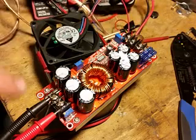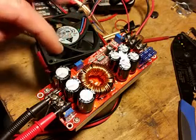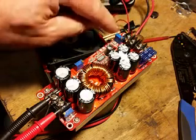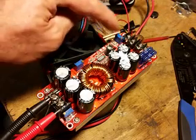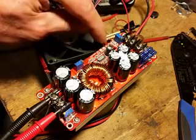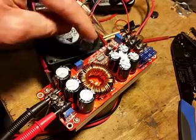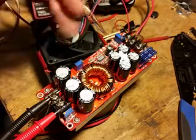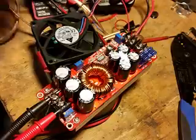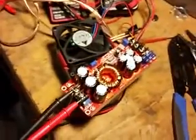I plan on hard soldering both ends once I decide how I'm going to install this unit. It did arrive a little different than the unit described — this appears to be a newer version. There is no jumper pin for the input voltage above 20 volts; it has this potentiometer. I don't know exactly where or how it should be adjusted — there are no connection points or terminals to put a meter along this path to determine what voltage is being fed into the regulators. The unit came with no documentation at all, so I left it alone. I'm running from a 12-volt deep cycle battery.